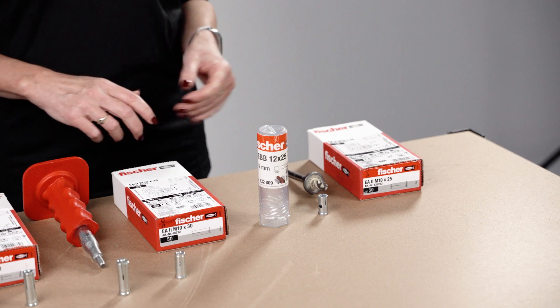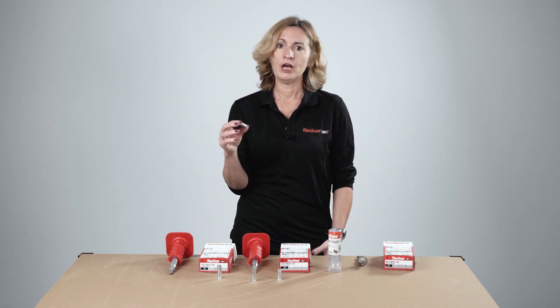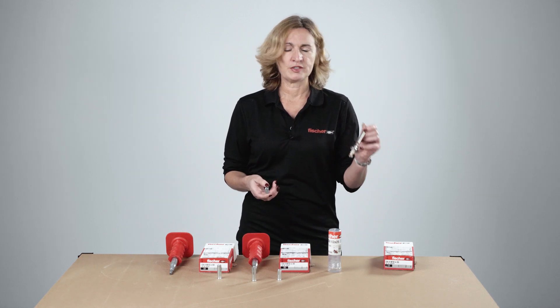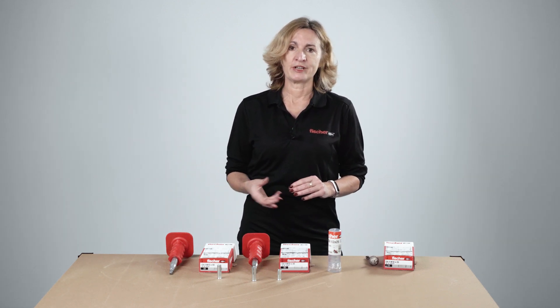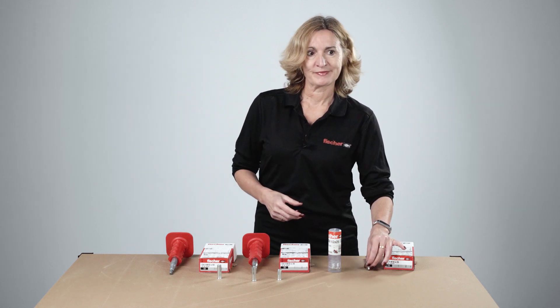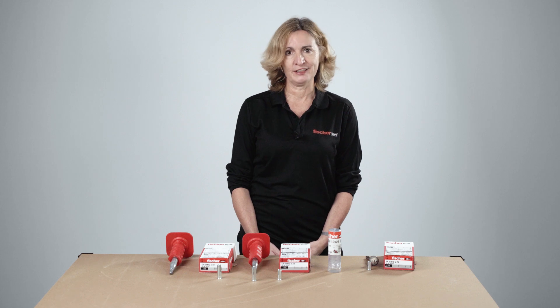We also offer a shorter EA2 25 millimeter version, which is fantastic, especially for jobs where you have a reduction on drill hole depth. This avoids hitting reinforcement — you can use a special drill stop to ensure you are not drilling more than 27 millimeters. This is perfect for dense reinforcement, pre-tensioned concrete, precast hollow core slabs with web thickness 35 millimeters or more, and also provides savings on installation time.